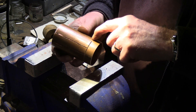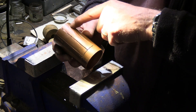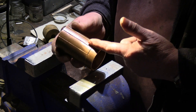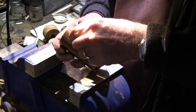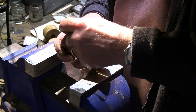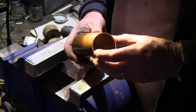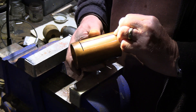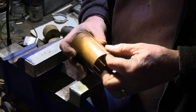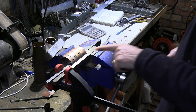I've made the cut down the length we want, and a cross cut as well. I've taken the depth of this cut just slightly past the scribed line — same on the other side — because this accounts for the thickness of the metal as we peel it back. The original scribe lines were just for the width of the firebox, but in order to bend it back plus the material thickness, we need a little bit more. So I'll anneal this to make the copper easier to work — just heat it up to a bright red and it will become nice and workable.